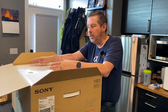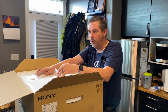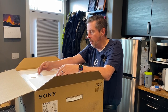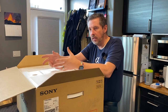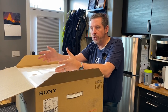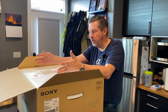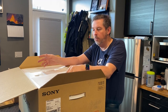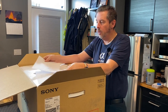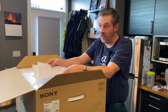My anticipation is that if this is a problem, and I've already talked to them, I'm going to send not the drone, but the remote away to get it modified so that it can use the AlienTech Duo 2 antenna, which will do the 2.4 and the 5.8 gigahertz bands of the signal, and it'll boost both of those significantly.